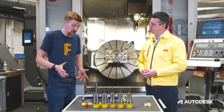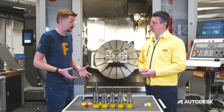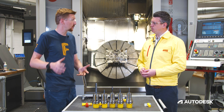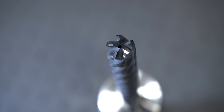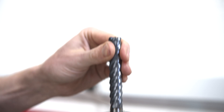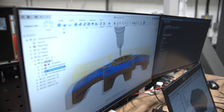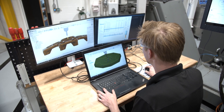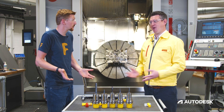So there's a lot of technology around the tool, and we just need to make sure that when we program this inside Fusion we're using it to the maximum — if you've got the flutes, let's use them, go full engagement with tiny step overs. Definitely — the tool is one thing, but making sure we've got the right tool path to match is really important. Perfect — let's jump into Fusion and see how we do this.